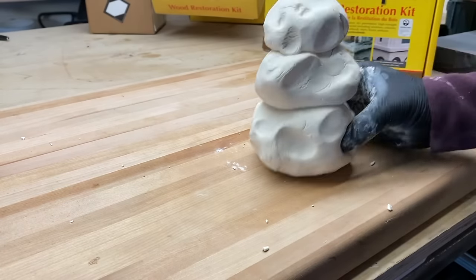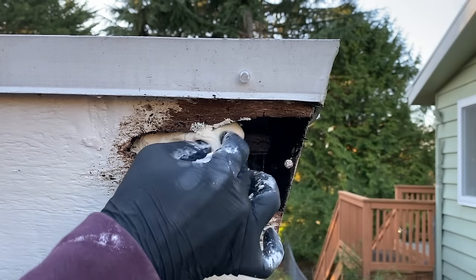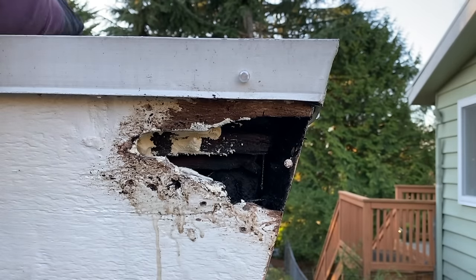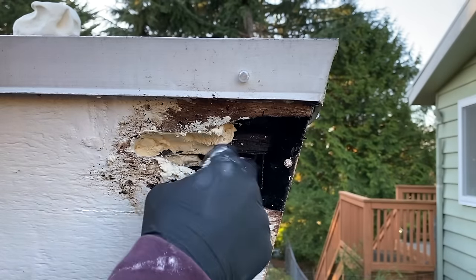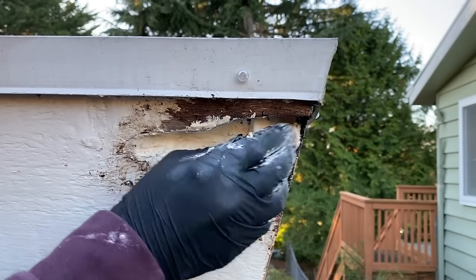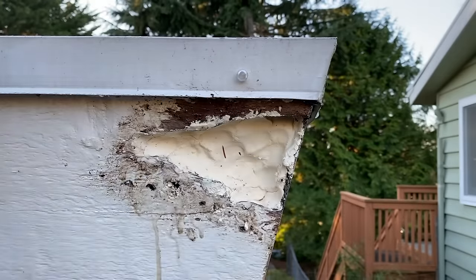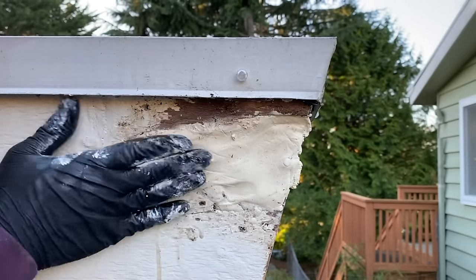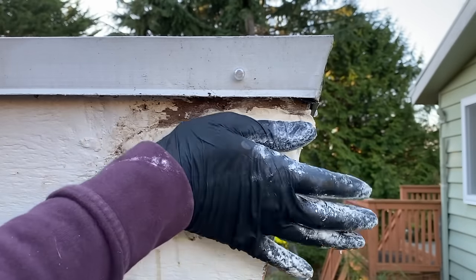In my case I have quite a large hole, so I might need a bit more product than some people. Just think about that before making up too much or too little. You're not going to try and jam all of it in there at once — work in small sections, mainly to ensure there are no air gaps when filling. If you put too much in at once, you potentially might not have good connection between the existing wood and your product. Working with small batches and making sure they get into every tight space is key. It is rather satisfying filling the entire hole with what seems to be Play-Doh, and the fact that this product in 24 hours should be fully hardened, ready to sand and drill into, is pretty incredible. Being able to fill a hole of this size and fully strengthen the fascia board without removing the entire board will save you time and money in the long run.